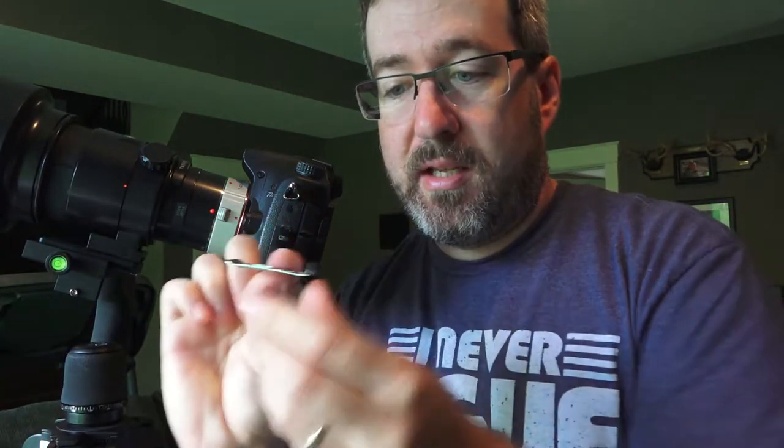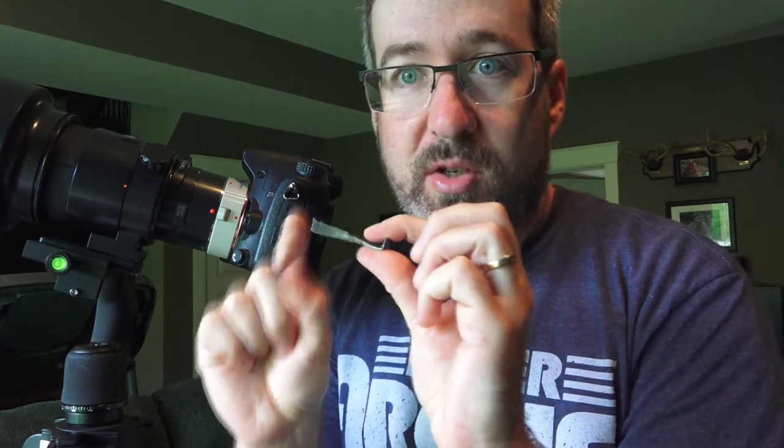I got thinking — this works well, but it might shift just a tiny bit over hours of use. A better solution would be to measure the entire length of the plate and make a plate that bends up on the back to hold the back of the lens mount securely, and also bends down over the front of the mounting plate. So we'll have a Z-shape: down in the front, up in the back. That way it'll be 100% secure. I'm going to use a piece of heavy sheet metal from the garage, cut it with a grinder, file it smooth, drill a hole for the screw, and there's your anti-twist plate — about 15 minutes to make and virtually free.